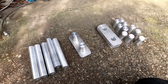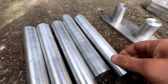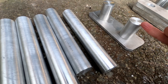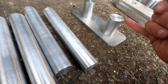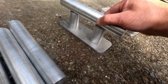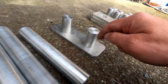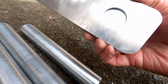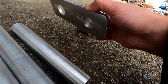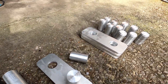A quick recap before I hand this over to my friend who has a CNC lathe. We have the top bar which is 35mm by 220mm long. These are 57mm high and a fish mouth will be machined in here so that there is a clearance of 40mm for the top bar. I have left 4mm on the bottom so I can weld all the way around and fill in the lip at the bottom, then sand that off — welding from both sides. After that there will be polishing and then these should be done.